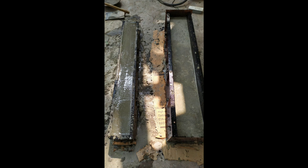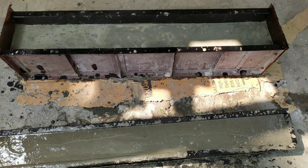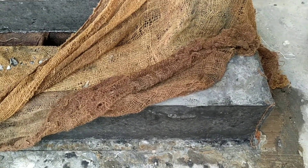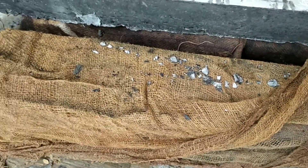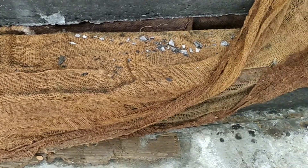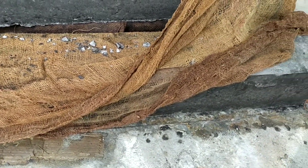You can see here the two beams have been completed and will be kept for 28 days of curing. After 24 hours of drying, they have been covered with gunny bags in order to carry out water curing.